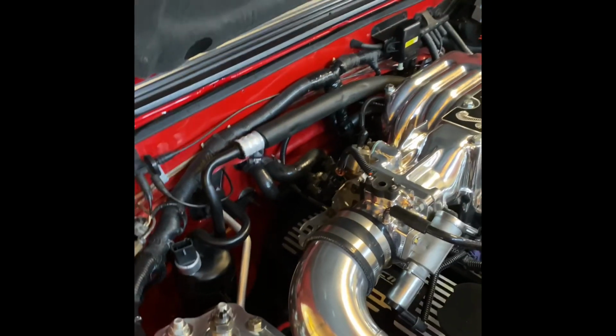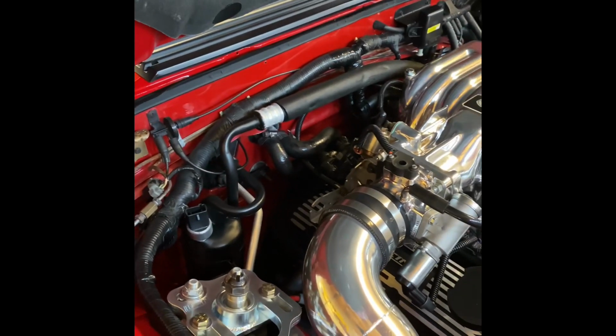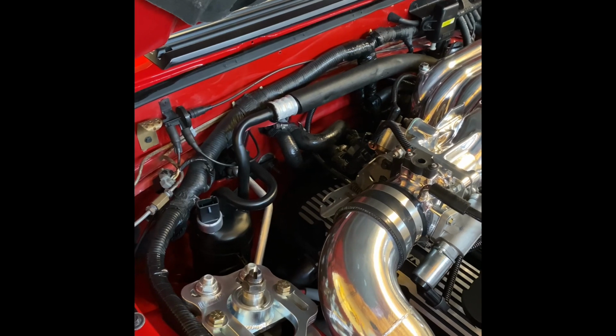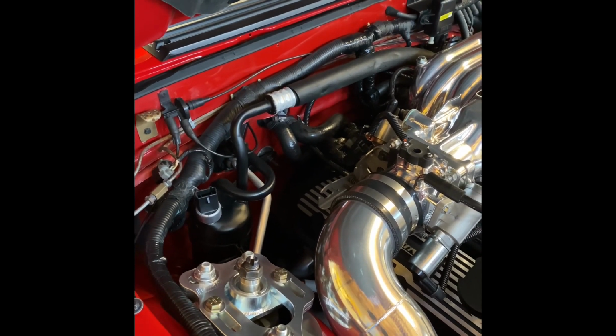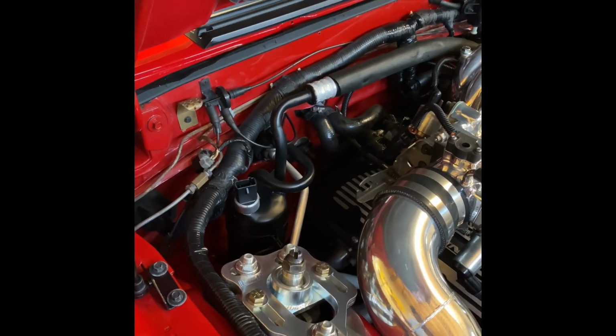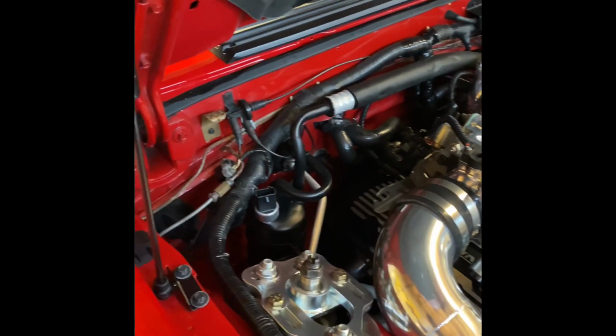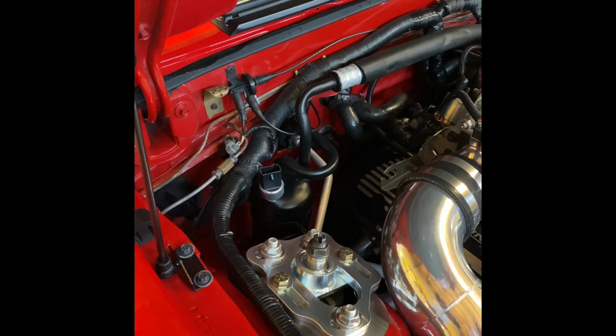Now, don't quote me off the top of my head, I can't tell you, but look up the pressure settings depending on what temperature it is. You know, the cooler the temperature is, the lower your pressure is going to be on your high side. So when it's hot as hell outside like it is now, you're going to be running a higher pressure on your high side on your compressor, on your gauges.